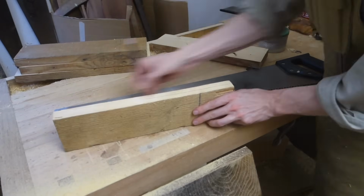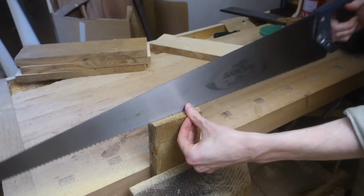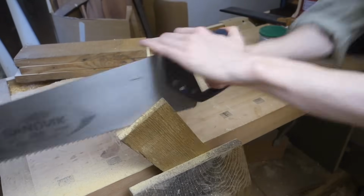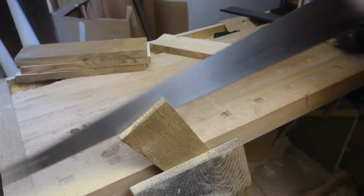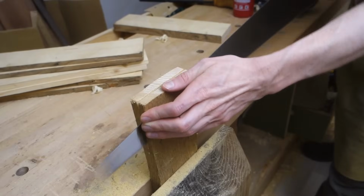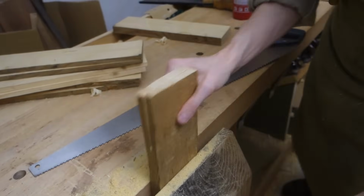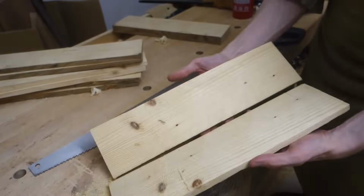I do it this way, halving it and then halving again, rather than taking one slice after the other at final thickness, because it helps even out the releasing of tension and the consequent warping. Pine is a very well-behaved wood, so it's not a big issue here, but still a good practice when possible.